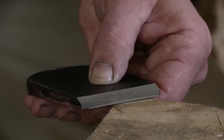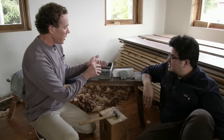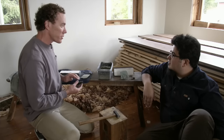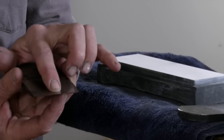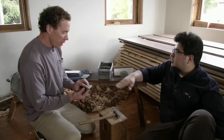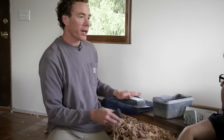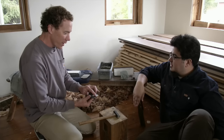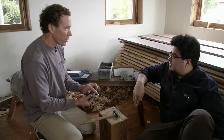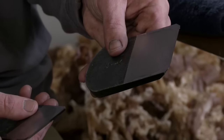It's not as violent as I expected — it really is tapping. You do a little bit of tapping, then check on a medium thousand-grit stone or so. You'll start to see the scratch patterns, and you'll see a bulge in the hard steel — that's where you know you're getting it where you want. You go back and forth between tapping and checking on the stone until you've bent the hard steel down enough to go back to your normal flattening routine. The goal is to keep the flats as small as possible, which is best for sharpening.